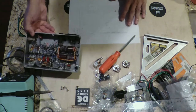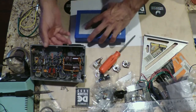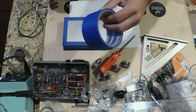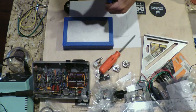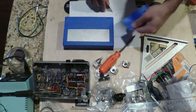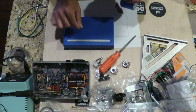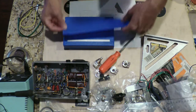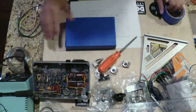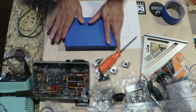We're back and going to mark up the actual chassis for drilling the various parts. I've already started using 3M blue painter's tape to cover the chassis, which lets me draw on it without making a mess. The tape is thick enough that if you use a scribe — a pointed object — and press into it at the drill point, it gives a small indentation where a small drill bit can get started, keeping your hole in position without needing a mallet and center punch.